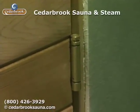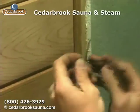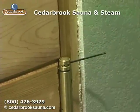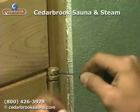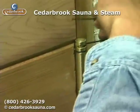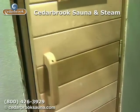Once you have your door installed, we provide you with hinge pins and a hinge pin tool. What you want to do is just slowly walk it over and load up the hinge. I usually do a couple little test runs before I actually put the pin in. You can just leave that in there and see if the door is swinging closed. It needs to be a little tighter, so I'll walk it up a couple more holes. That works pretty nicely. So I'm going to go ahead and slip the hinge pin in the hole like so. And now you've got your self-closing door.